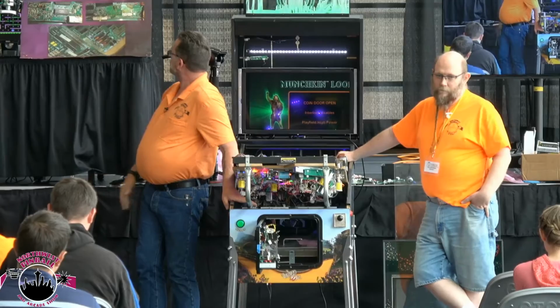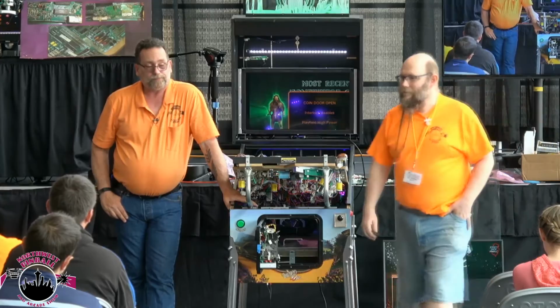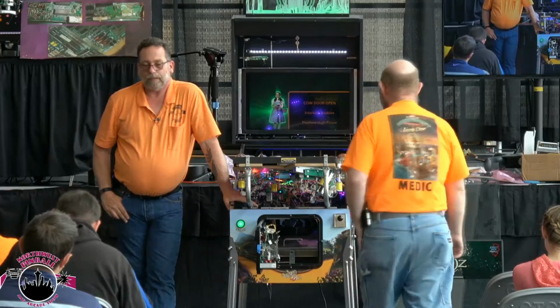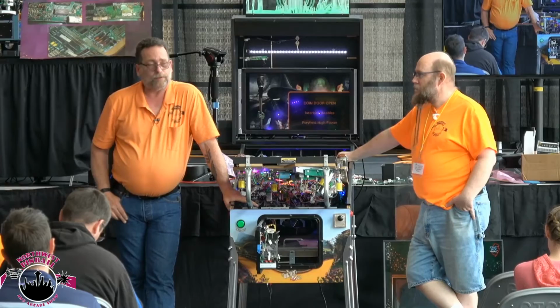And I took in a Superman, which is one of the seven deadly Ataris. As there are seven deadly sins, so shall there be seven deadly Atari pinball machines that all have white wiring. I took that MPU and I set it in a solution of vinegar for probably about a week. And about 3 days into it, parts started just falling off the board. There was that much acid corrosion in it.